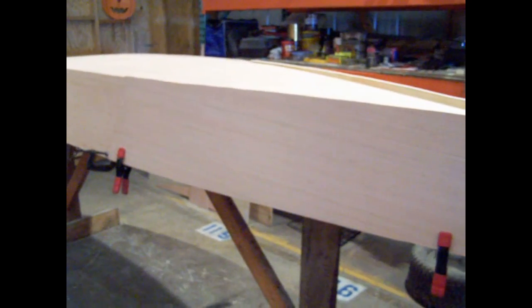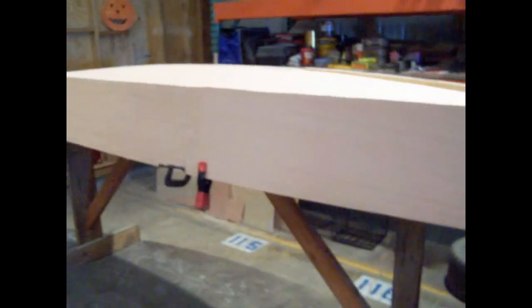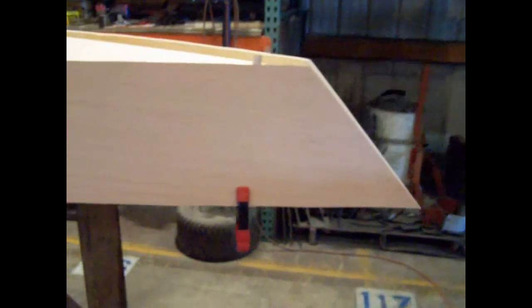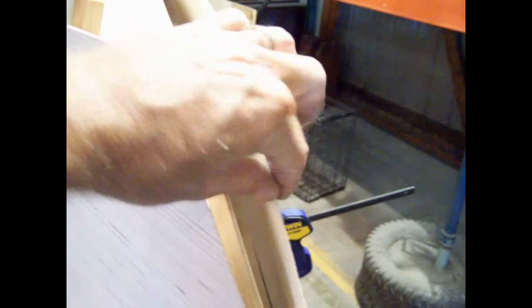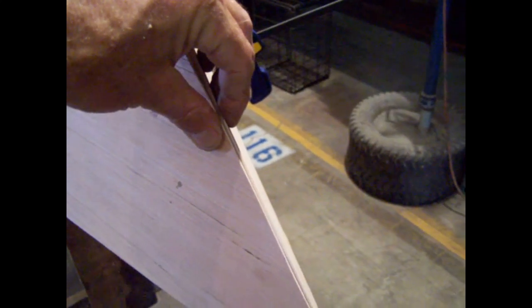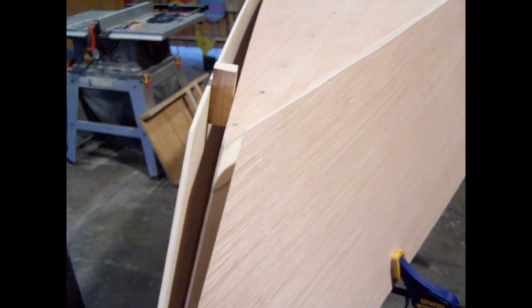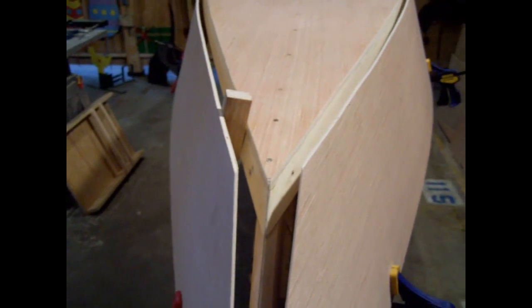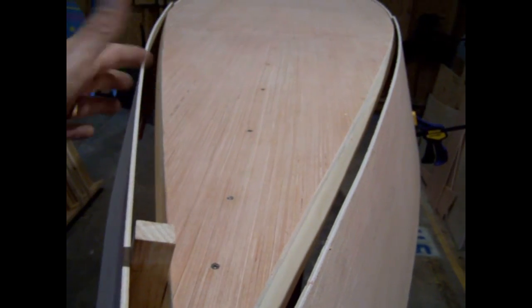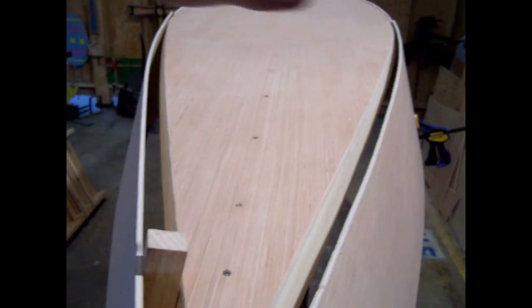Okay, I got the other two pieces on this end done. They're a little trickier too because you got to make sure you keep this end tight and square. And I do both pieces like I said before, so I can taper the very tip so that when you go to put them together, you get a nice tight joint. So now that I got them both done, I can go ahead and glue. And I've been using a trim nail gun because the 5/8 nails seem to hold it fine, because I never figured out how to clamp up here short of making some special blocks and having long bar clamps.